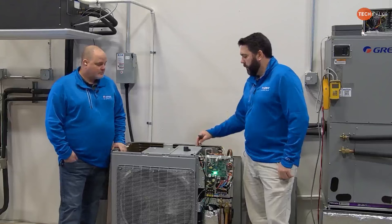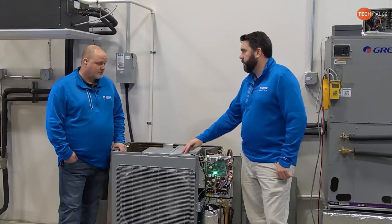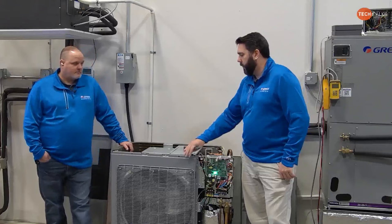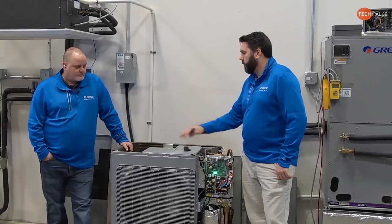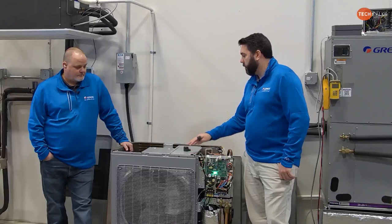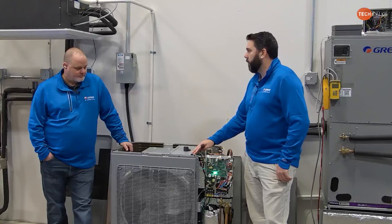The other thing that I will also add to that is with that job site sheet, we talked a little bit in MultiPro at the beginning about load calculations. And I don't care if you're installing this on a 100-year-old house, there needs to be a load calculation when you go to do that, regardless of what system's there, regardless of what company installed the ductwork in the beginning, regardless of any of that. The contractor should be doing his due diligence, which is why they're licensed contractors, in making sure that what they're putting in is going to work properly for their customer. I can't disagree with any of that.